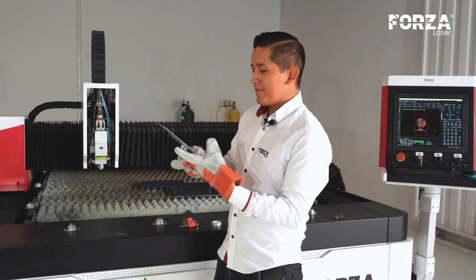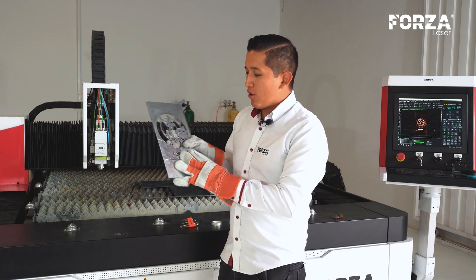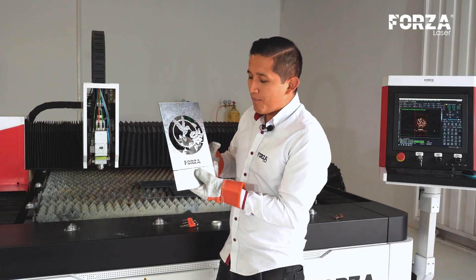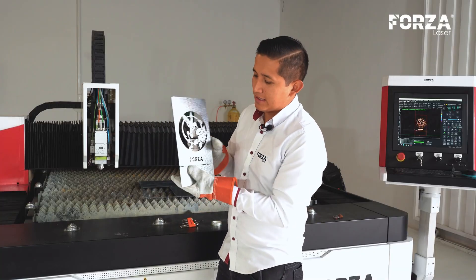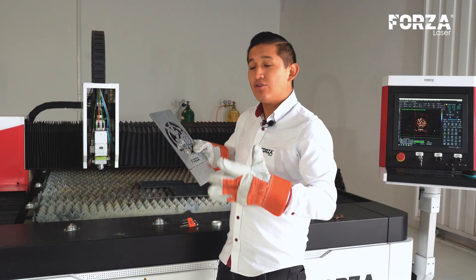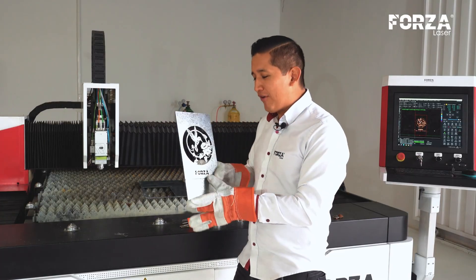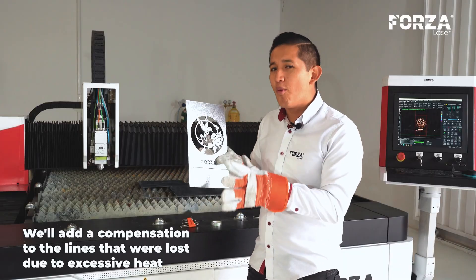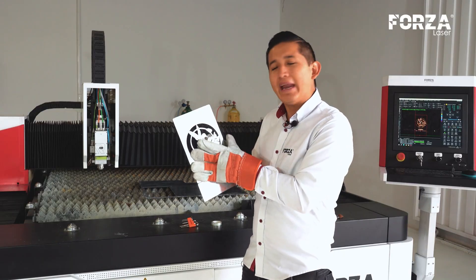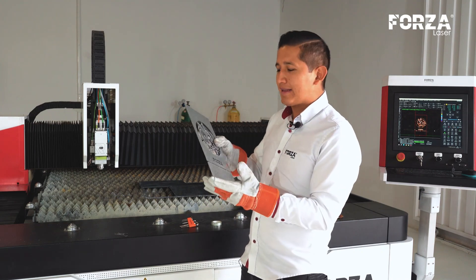Here we have the 30cm piece in 3mm galvanized steel. This piece came out quite well on both sides. However, we lost some small details — specifically, a couple of very thin lines that, due to the excessive heat, basically melted. What we're going to do to make it perfect is to increase the compensation. Our software has the ability to compensate for the cut width so that the pieces come out the exact size. So we're going to make this change and try this cut again.